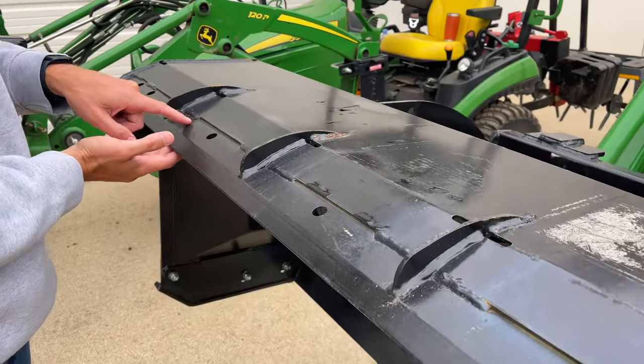Here's a look at one we've outfitted all the way with UHMW — UHMW on both scraping edges and UHMW skid runners as well. We went about as thick as you'll see: an inch and a quarter thick on the edges and an inch and a half thick on the runners — way thicker than what others are selling. The runners are slotted, whether steel or UHMW, so as they wear down you can get some adjustment out of them. You can also control the depth of the slots on the skid runners to raise your main cutting edge off the ground if needed.